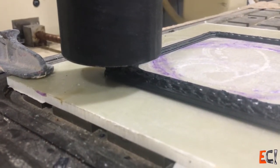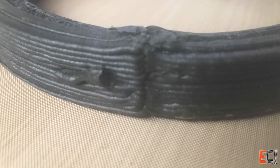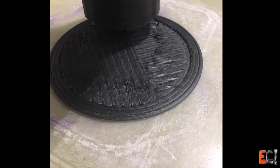Another problem was path control in Simplify3D. I couldn't get it to traverse around existing paths, so the head would be smearing existing material and crashing into globs of extra material left when the extruder speed wasn't perfectly matched with the path speed. I think using some kind of constant velocity feed — treating the extruder like a rotary axis in the CNC control — might help. There was a lot of surging and stringing, and the starting and stopping were not very tidy. So it worked, but it didn't work.